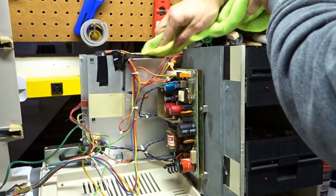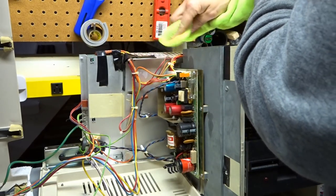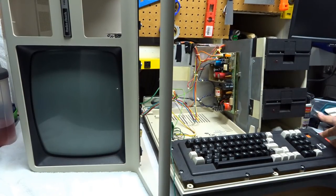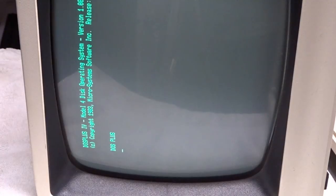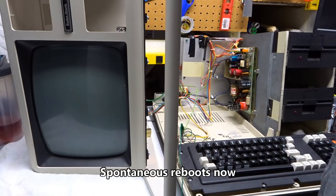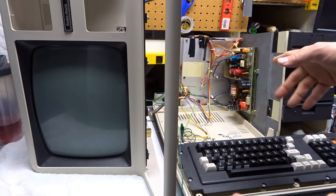I got Deoxit on the tape and on the top of the motherboard — let me clean that up. Okay, let's turn it on after hitting it with the contact cleaner. Boots up normally. I'm going to push on the power connector on the top again... still bad, not enough voltage. I've got to take this off and take a closer look at that power supply.